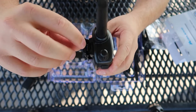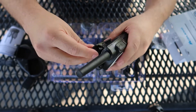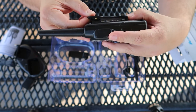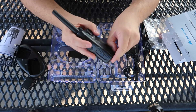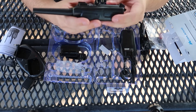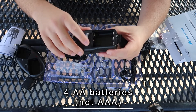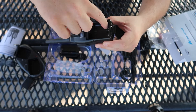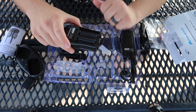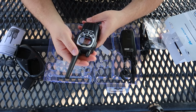This can also be substituted with five AAA batteries, so if these batteries die and you don't have a way to recharge them, you can use five AAA batteries. Up at the very top we have our clips that clip onto the back of our radio. Installing that is as simple as just sliding down till it clicks. To release the clip there's a little tab — you'll push towards the outside and then slide it up. To change the battery there's a little latch on the door, then swing it up to insert our batteries. Your battery pack comes with an extra tall standout to go in that hole.